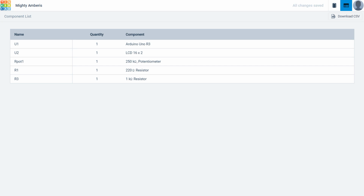This simple circuit tests the resistance of electrical components. Place the unknown resistor you want to test in series with the reference resistor connected to ground. The Arduino will calculate the resistance and display it on the LCD and serial monitor. The resistance of other electrical objects can be measured with the Arduino ohm meter as well.